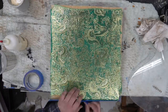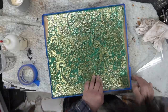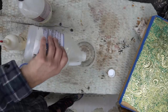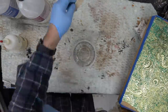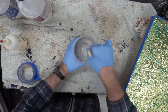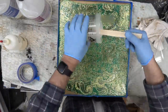We're going to tape on a border as a dam for the epoxy — that didn't work out all that well, and I'll show you what I did further on. The epoxy is a 50/50 mix, so eight ounces of Part A and eight ounces of Part B. I mix it for about five minutes, but the first batch I mixed a little too rough and got too many air bubbles — that cloudiness shows the air bubbles.